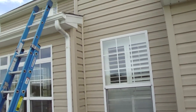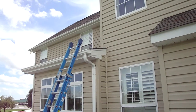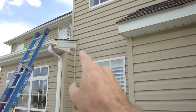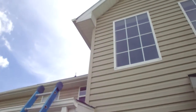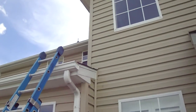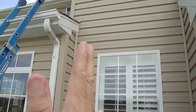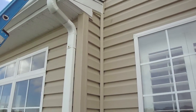To really truly know what happened with that intrusion, a water test right in this area is the answer. There are enough things going on here that a nor'easter — something blowing rain this way, facing north — could light that leak up. You've got that bigger corner post going all the way up. It's not much on the ceiling; it looks like it's actually coming through the wall cavity and kind of whipped into the ceiling. It looks more like it was coming in the cavity of the wall and went that way, which tells me it's something right in here.